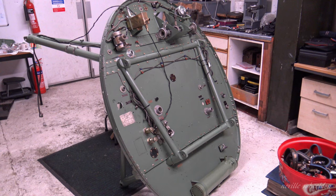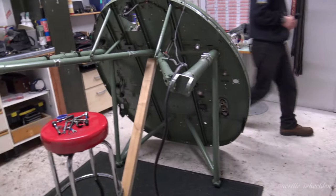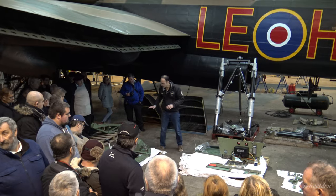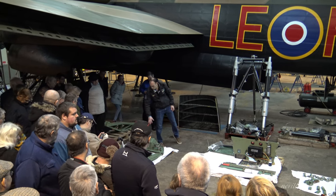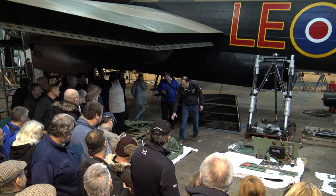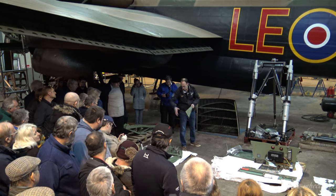The bulkhead was assembled onto the subframe with all the relevant parts by Brad inside the workshop. It's all connected to allow quick disconnection to change the power plant — so if you had an engine failure during wartime, you'd remove the whole power plant section and bolt a new one on. Everything can be disconnected from this bulkhead. You've got hydraulics with the brass fittings here, fuel, fuel priming, oil, and up on the top section you have an oil and water trap, your booster coil, and your throttle box with the throttle linkages that go back through to the engine.